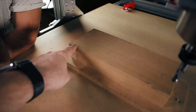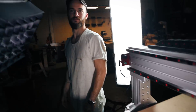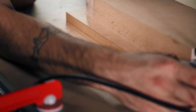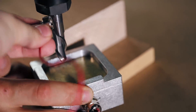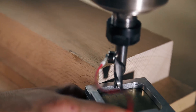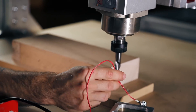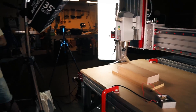Obviously there's something wrong — I'm an idiot because I set the zero here but I actually set it in the part, so right now I was five millimeters too high. I need to set the zero here, actually here, and I even knew it, I just forgot. So now I need to re-zero with this surface and Gabriello is gonna hold it because he trusts me. As usual, I forgot to attach the probe to the bit — it was attached to the wrong thing so it thought it was already zero. Let's see if it works now.